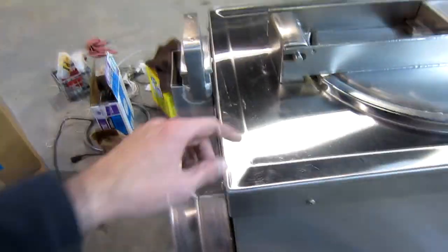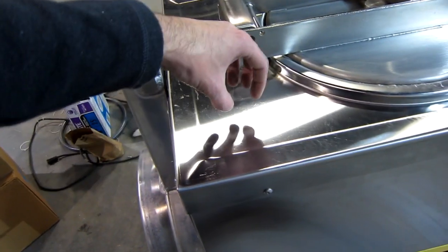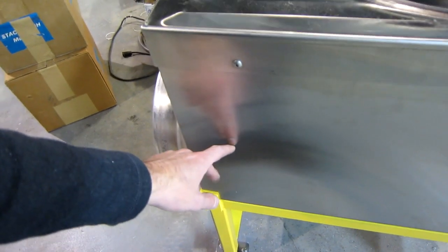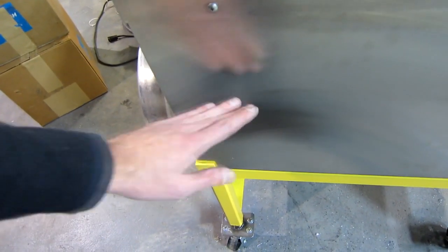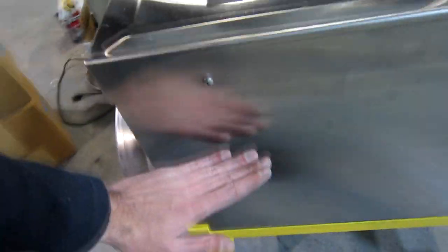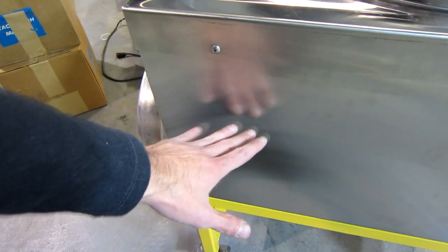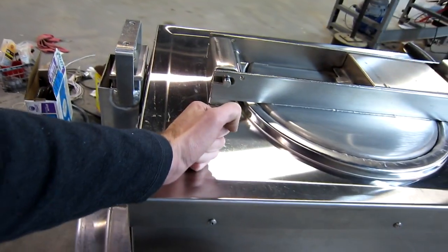I'm very seriously debating drilling some holes in the top and installing some manner of lifting eyes, like putting in a big piece of threaded rod that would go down, because this is just open air in here. Put a couple big washers on it with a bunch of nuts to hold it in place, and then spaced a few places down here, big washers, and when the concrete dries, those will be locked into the concrete and I can lift it by the lifting eyes, one on each corner.